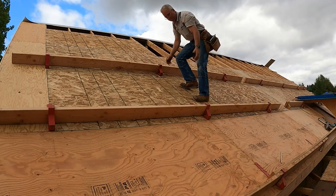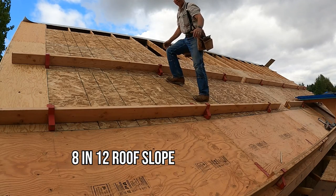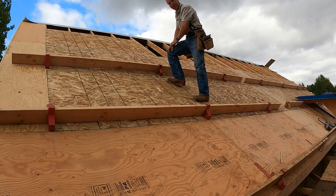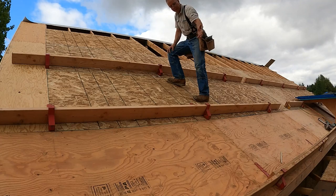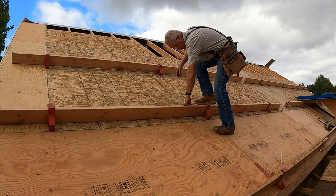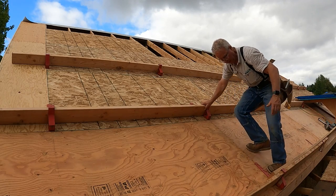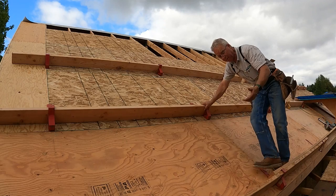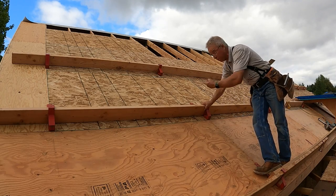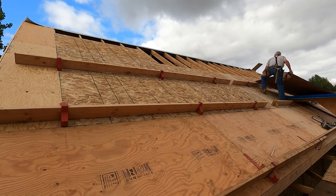This is a pretty good demonstration of the added safety of OSB. I'm stuck to this pretty good. You probably saw me being foolish over on the other side, sheeting it without the toe boards — it was foolish. I have a hard time standing on that plywood face after it's been out in the weather for a day and a half. But the OSB does two things: it's safer, and it saves a ton of time not having to snap all those lines for nailing.